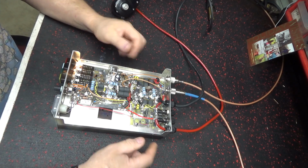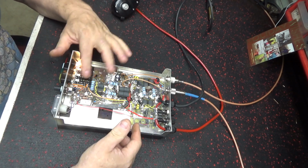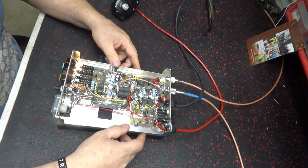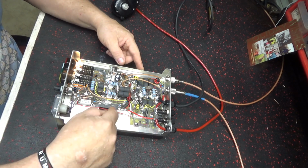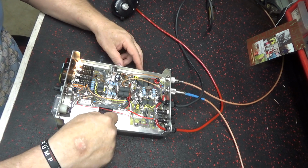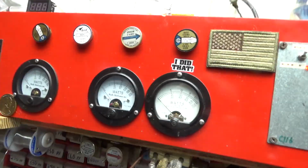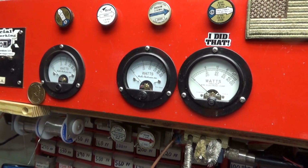To make sure. These Texas Stars, I don't know why they do it. The newer ones like this with this set of switches in it are different than the older ones. And they have some wattage coming back from the antenna, and it's backing back up into the amp. The input tune looks great back towards the radio, but it has power coming back from the antenna. If you get up on a dummy load, you won't see it. And that's the reason that amp is here, because the guy, I guess he has a setup like mine.